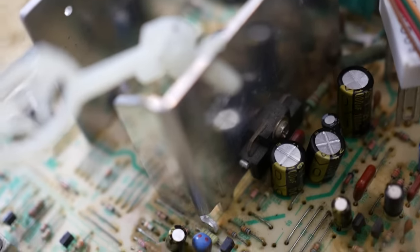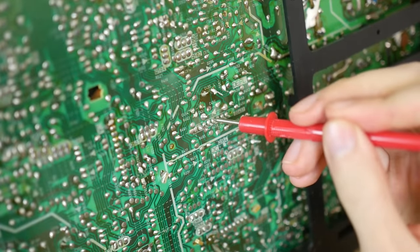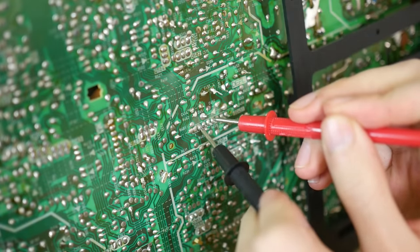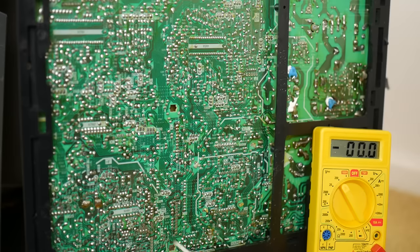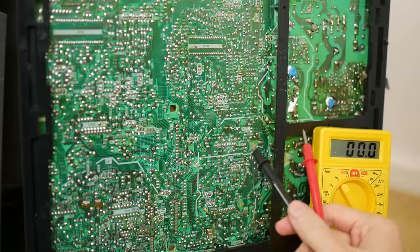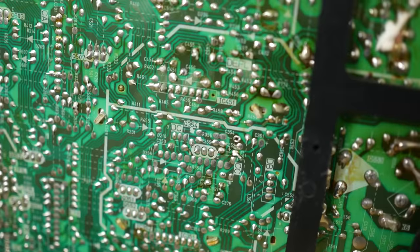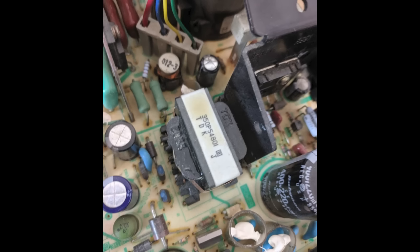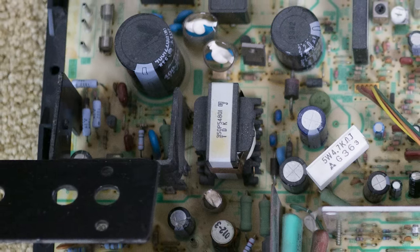I managed to locate the vertical deflector chip, which is the thing most responsible for the up and down movement of the electrons. I found the datasheet for it, so I knew what each pin did and checked the voltages. What I found was that the power going to this chip was tiny. According to the datasheet, pin 5 should be 2.5 volts, and it wasn't. I traced the power pin for the vertical deflection IC to a transformer. My lack of analog knowledge failed me here - while I knew this wasn't the flyback, I had no idea what it was. Searching the model number came up with zero results, but it was made by TDK - the same company that published Shrek on the Xbox. With no documentation and little analog knowledge, it was hard to tell if this was broken or not. And I never found out.